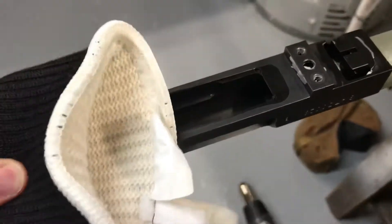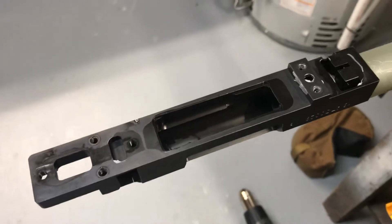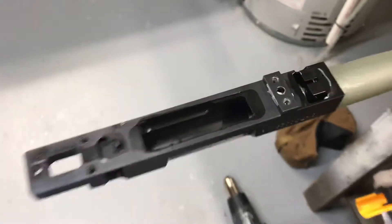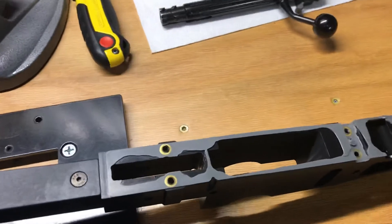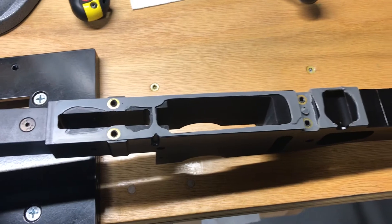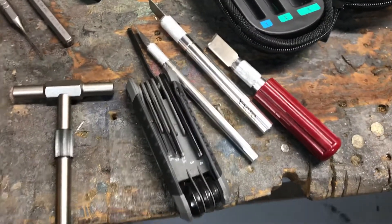All I do is I just have a heat gun. It probably took about 10 minutes of heating it, going all the way around, heating up the joint. And then I was able to just pry the chassis apart. The epoxy all stayed right on the chassis itself — there's hardly any on the action. So I have my X-Acto knives that'll help scrape it, like a flat one.